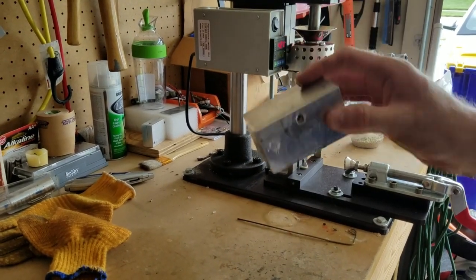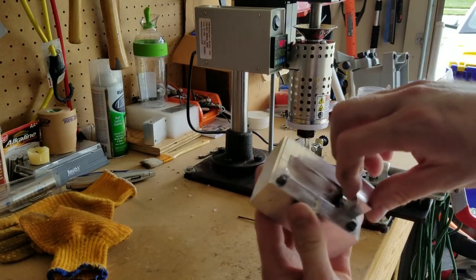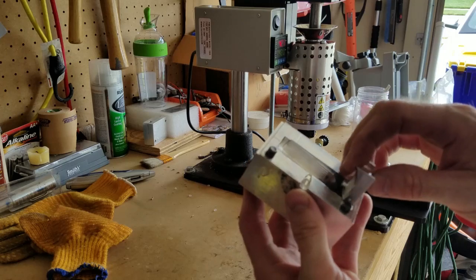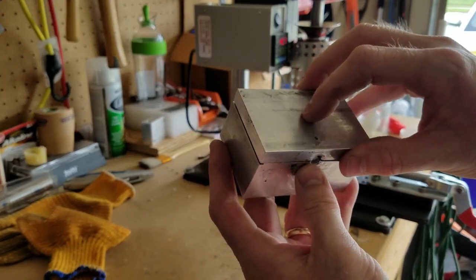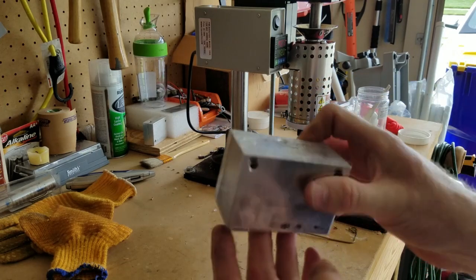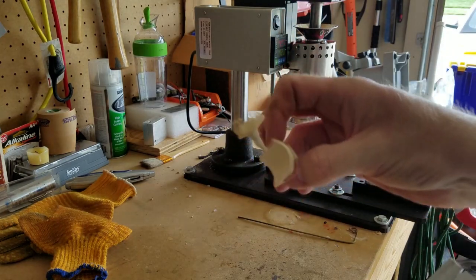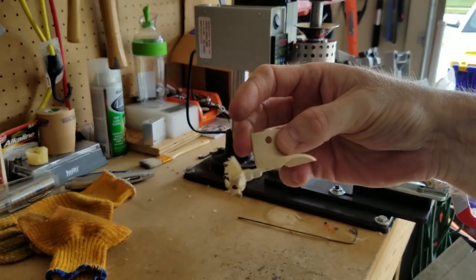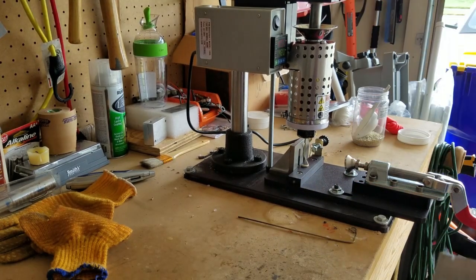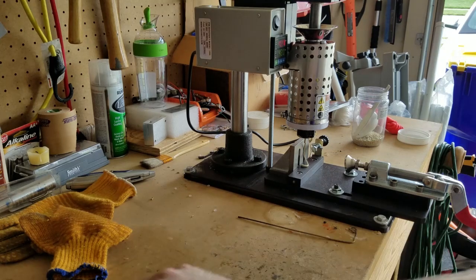Got my mold — this is the mold for my pigtail wedge. I highly recommend benchtop molds; I'll put a link in the description for that, he does a great job. And that makes this — this is my pigtail wedge. I did one shot just to get everything up and running. We're at 420 degrees, which I found is best for ABS, which is the plastic that I'm using right here.